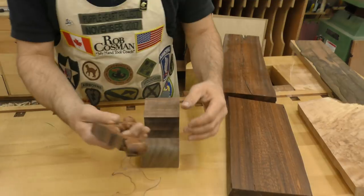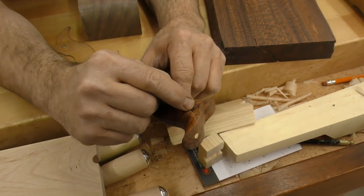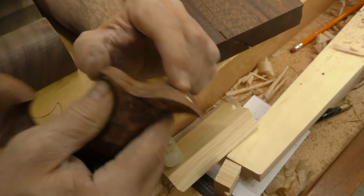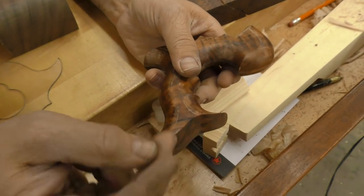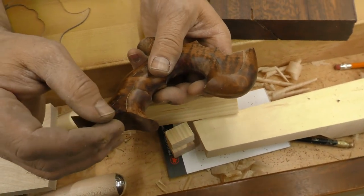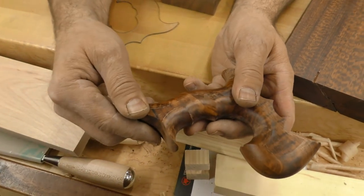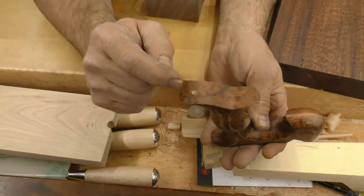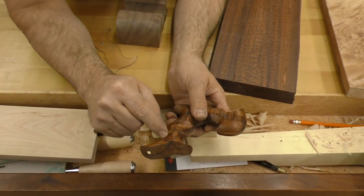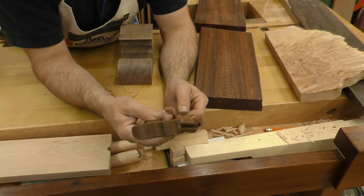It's the first one so far. It had a bad crack — not just a check but a crack right here. That crack was actually almost as wide as you see that black line. So the first thing I did — you see how it goes right down around here and right down around there; you could actually take it and flex it slightly — I first filled it with thin cyanoacrylate, which went down to the parts that were actually touching. Then I used medium cyanoacrylate, which went a little bit further, and then I filled it with the heavy, really thick cyanoacrylate. I still didn't want to rely on just that, so I drilled a 3/16 inch hole up into the handle and inserted a brass rod. That brass rod anchored in the solid stock will prevent any stress from being able to break open that joint. You can see a little bit of brass on there, but that's just part of something you have to live with.